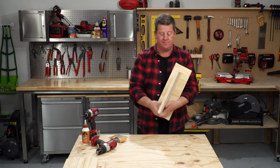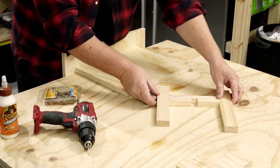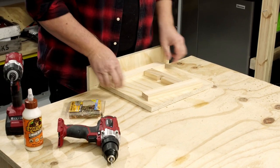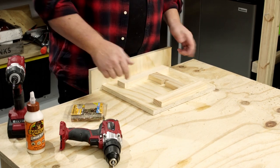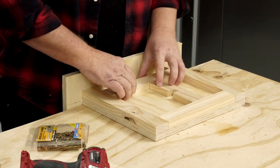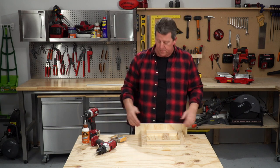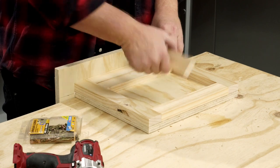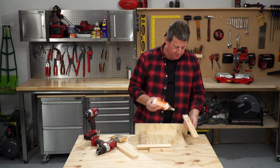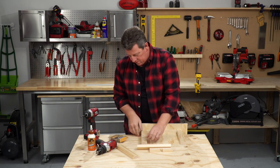So now let's fill it in. Our pot plant stand is going to be creating a shape similar to that. If we put that on our template this way, you can see how our template might need to go, and all we now need to do is create a surround to support this. Grab our two longest pieces at 295mm, position them on the outside, and one of our pieces at 250mm and position it here. Get ourselves some glue, glue them into place.